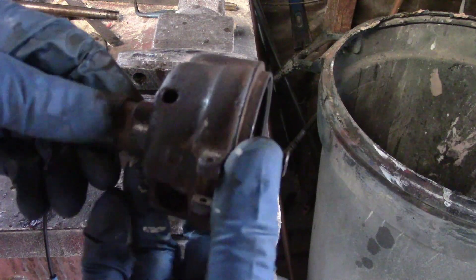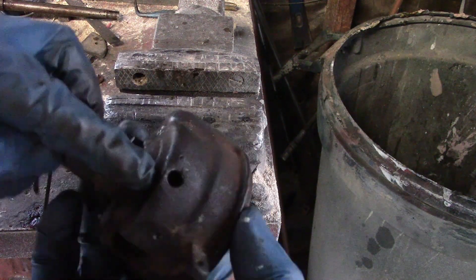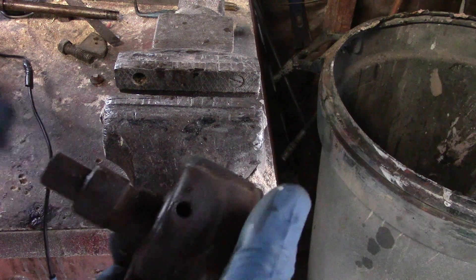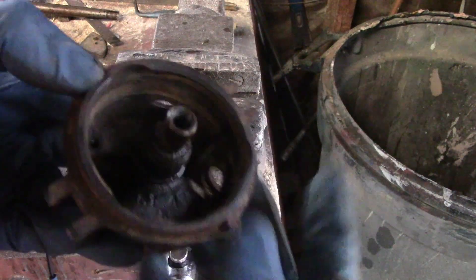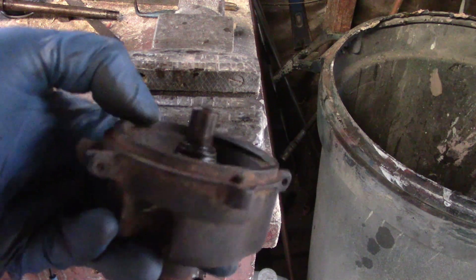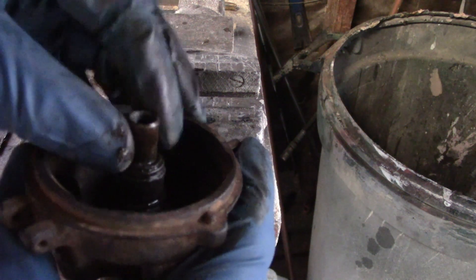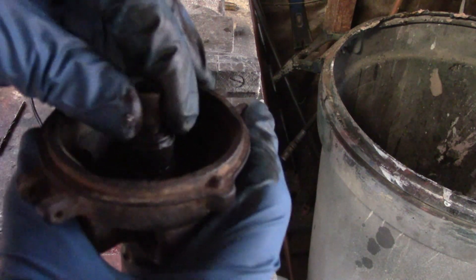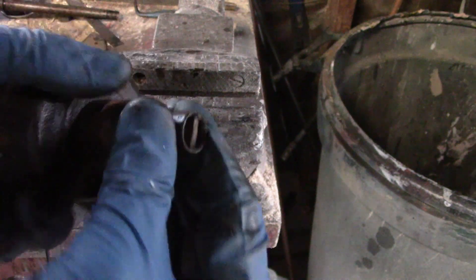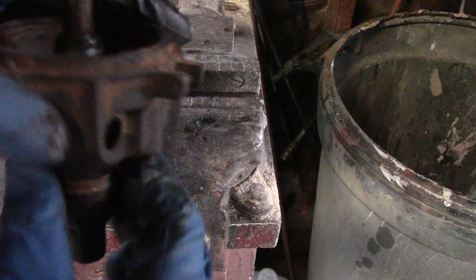And here it is. The oil passage was clogged solid, so I had to remove the fitting and ran a drill through it. I've been spraying oil on this thing and got it freed up. The shaft turns really good. Also, it appears the bushings are still good — they're not loose at all. So that's good. Don't have to replace them, because that's a hassle.